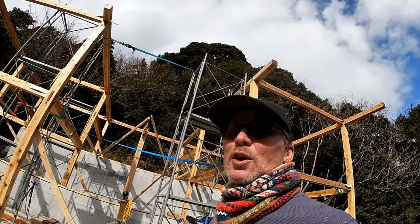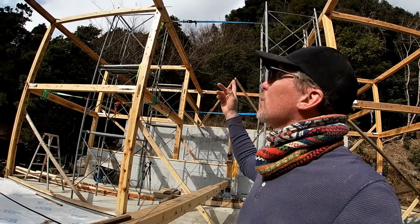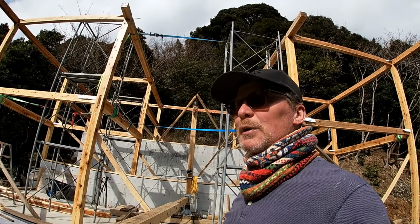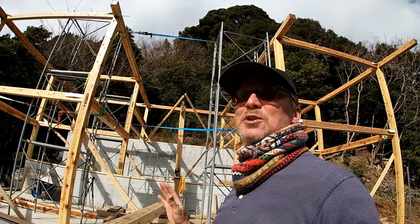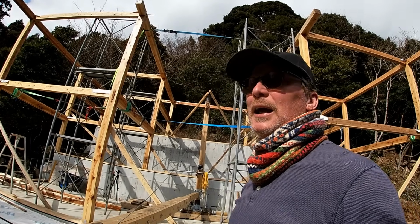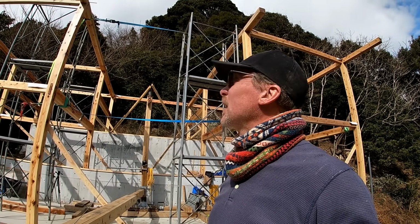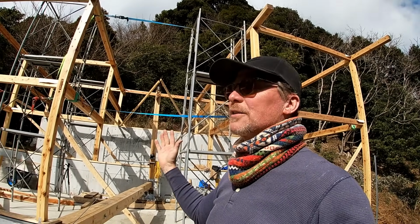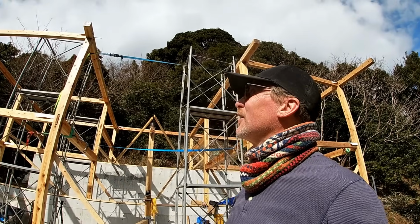Now, a couple of days ago, when we were still dealing with the crane up, we put in a temporary spacer board up there. But that's where I really miscalculated or mismeasured. And I made the spacer board almost 6 inches wider at the top than the posts are at the bottom. And it sat like that for 2 days. And when we finally realized our mistake yesterday and took it down, the bents had kind of settled into that wider stance. And so thus the requirement for pulling them back together.